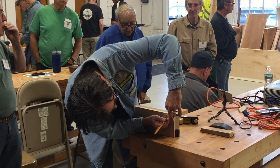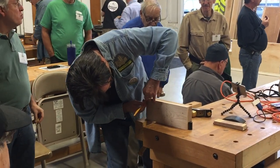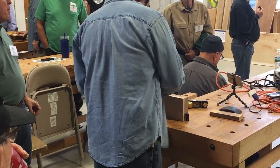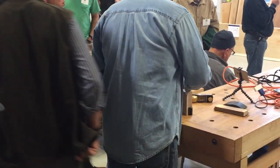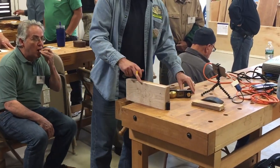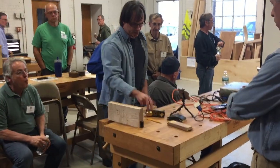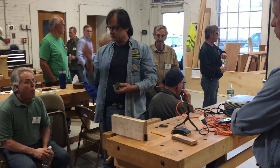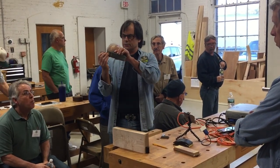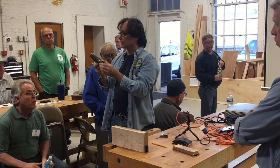I'll do that in this case, just for the purposes of the demo. I'm going to mark the same distance on both of these surfaces. And if I'm doing a 45-degree chamfer, it should be even between those two lines. One of the things when you adjust your hand planes is it's always really handy to have a little piece of wood so you can see how you've set your plane or blade.